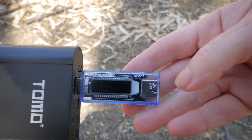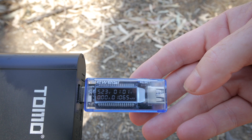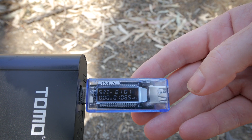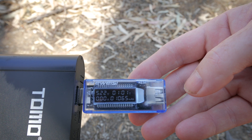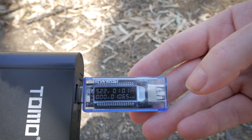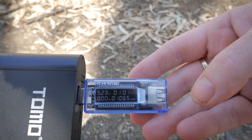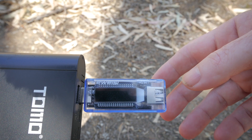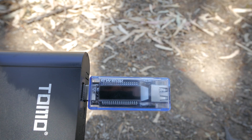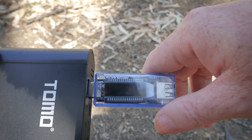Let's see what this guy actually put out. I'll plug it in here so we can actually see it. Alright, so it was on for one hour and one minute and it gave out 1,065 milliamp hours - so it's a little bit over an amp. That means it averaged about one amp for an hour. This panel normally does a bit better than that - maybe it's got something to do with having the testing devices connected - but any which way, it's still respectable. I'd be happy with that.